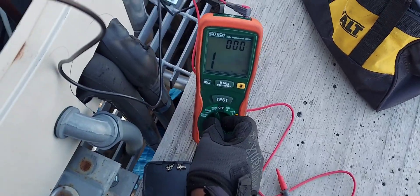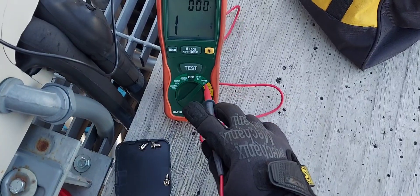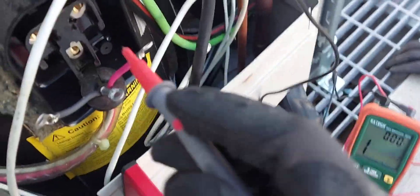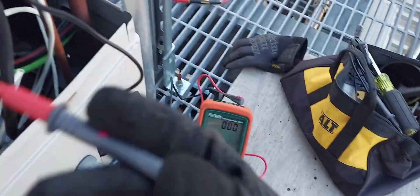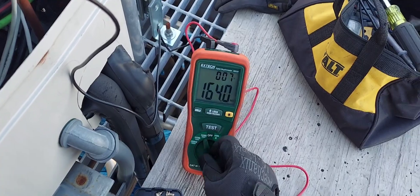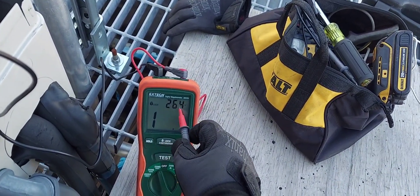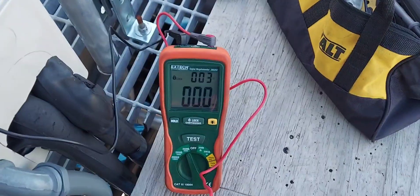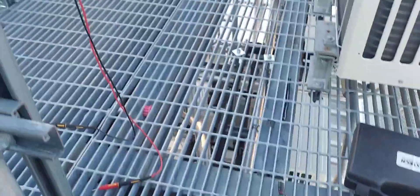So to demonstrate: on a regular meter scale — probably putting out nine volts on these leads — touching the compressor terminal I'm getting 62 to 63 ohms. That's still bad. But if I go to the 250-volt scale where I'm actually putting out 265 volts across these leads, I now get zero megs and the voltage sinks down to zero. That's like a dead shot — diagnostic is done.